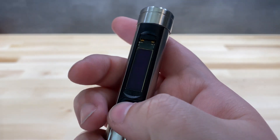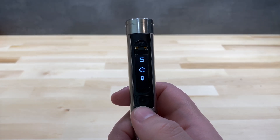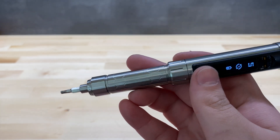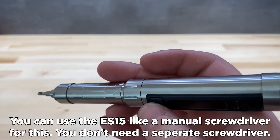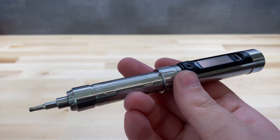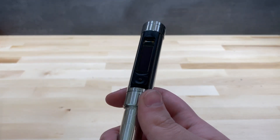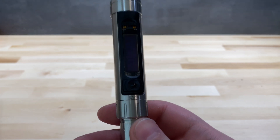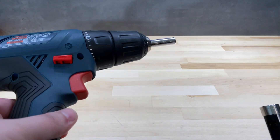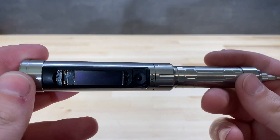You can change the torque here — five is the highest setting and I keep it there as I find the torque barely enough. The ES15 has an advertised maximum torque of 1.6 kg/cm, which is better than the ES121 but still not a lot. You may need to manually start or finish screwing, especially with self-tappers. For most electronics applications it's more than good enough, but for heavy self-tapper work you'd want a cordless drill.